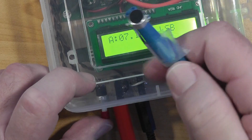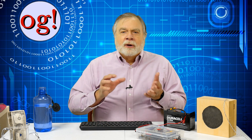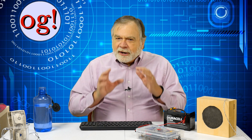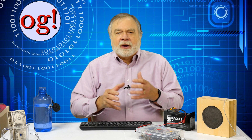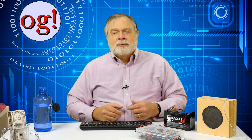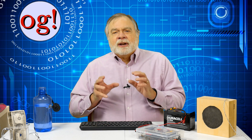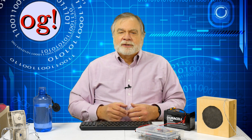Some other observations. Operating the push-to-talk button creates quite a bit of audio noise. Also, and I think you can only hear this with headphones, for the first second or so into the transmission you'll hear yourself. That's because of a unique feature of this rig called bidirectional amplifiers — the audio literally goes through the circuit one way when transmitting and the other way when receiving, depending on which transistors are turned on. Upon beginning transmission, the capacitors in the receive direction haven't quite fully discharged, so I hear my own audio played back to me, but very quickly the receive path fades and the transmit path takes over completely.